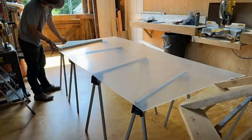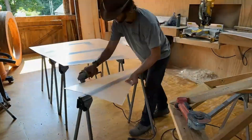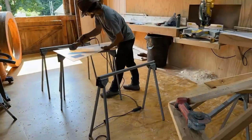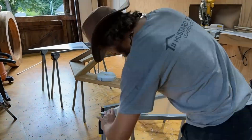I'm sure there's a better way to cut this stuff, but I used my grinder to cut each piece. It had the effect of partially melting the polycarbonate, which would then accumulate as a slag on the edges of the cuts. Going back with the grinder on an angle, I cleaned off that melted slag and made the pieces pretty. You definitely want to wear a respirator if you cut this stuff.